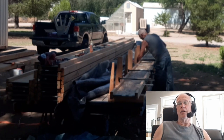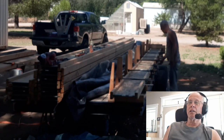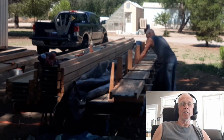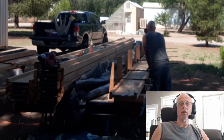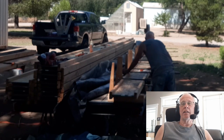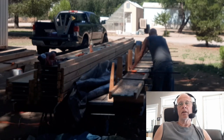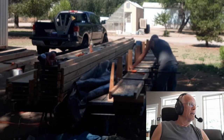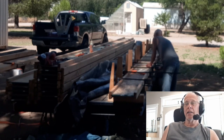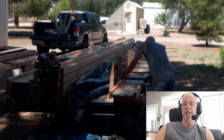All in all this worked out incredibly awesome. To save almost $120 each — and if I added in freight, I think I spent less than $900 on all 22 of these. I went through probably 10 bottles of Gorilla Glue at $23 a piece, so that gets kind of expensive. But I like the urethane Gorilla Glue because it expands and foams up in there, giving you a better mechanical bond. I'd rather that than have it fall down on me in 10 years.